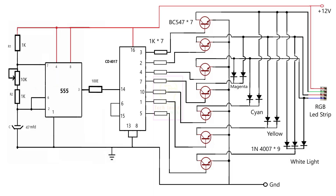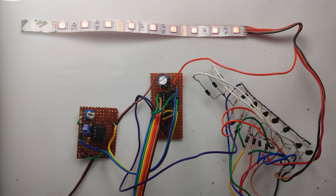This is the full circuit diagram of the chaser. The RGB LED strip is common anode type, which means positive is common to all LEDs. The diode will block the current flow to other LEDs when the pin is in the on state. The diode will do the magic of switching on the correct LEDs and switching off the others. Let us power it up and test it.